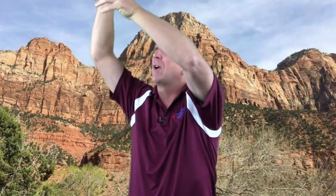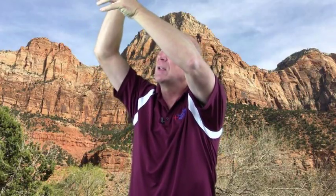Another thing you want to make sure doesn't happen is you don't want any specks on the floor. If I'm up here working on this popcorn ceiling texture and trying to get everything into the vial, you want to make sure we're not raining particles down onto the floor. If that does happen, you want to make sure they get picked up so they're not being walked across continuously, sending asbestos fibers up into the air where they get breathed and cause lung issues.